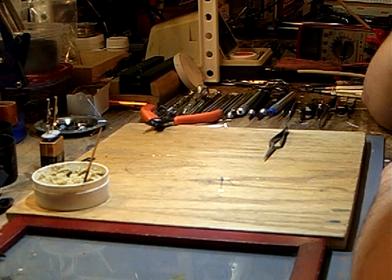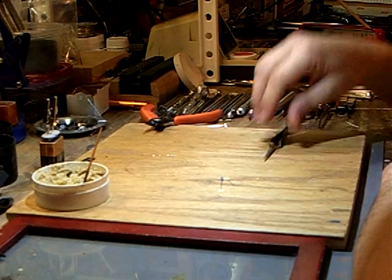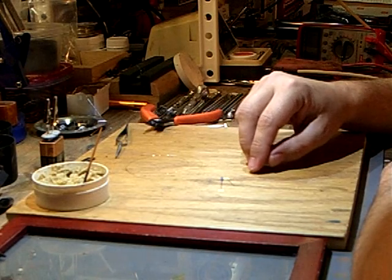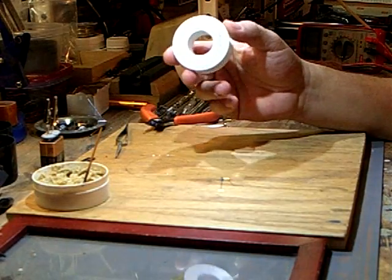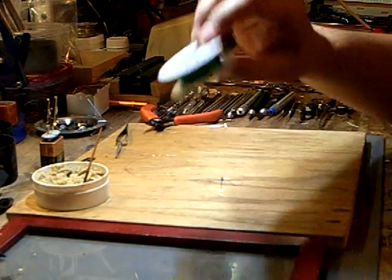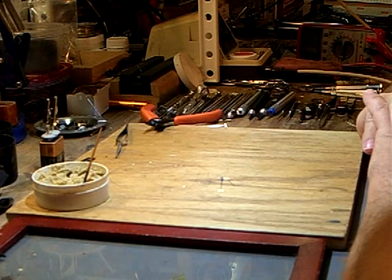These are really tiny lights and they're really nice for mounting in scale models. They can be used in model trains, model cars, model planes — the applications are endless. But the biggest problem is the size of the wire. The smaller the LED, the harder it is to put a big wire on it, so we're going to use 38 gauge magnet wire, available from SBS4DCC.com.